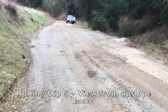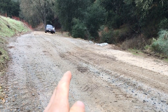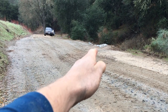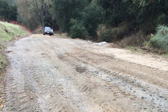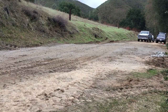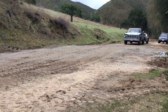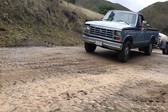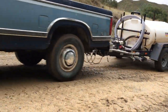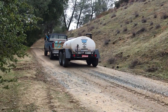Here's the view from the top of Rolling Dip 5 looking down the water course. Water will come right here in front of the camera, follow this low point right to the drain, and vehicles have a nice easy way to cross the road. This is as good a demonstration as any — a trucking trailer passes over the rolling dip, one side drops first, then the other, with plenty of clearance.